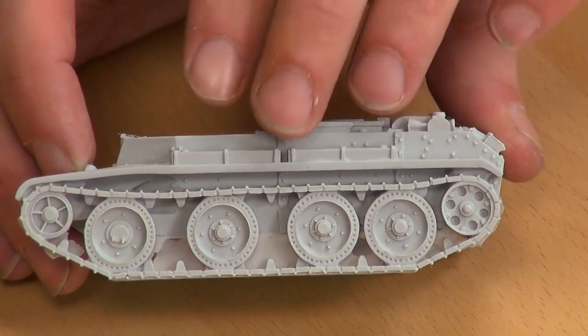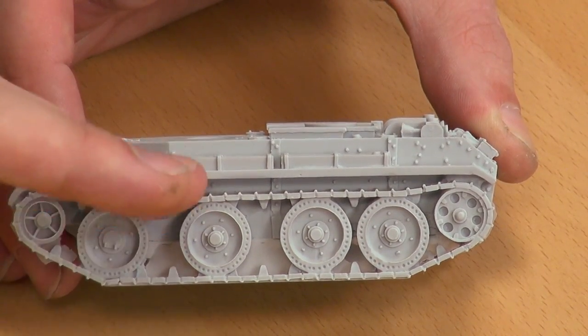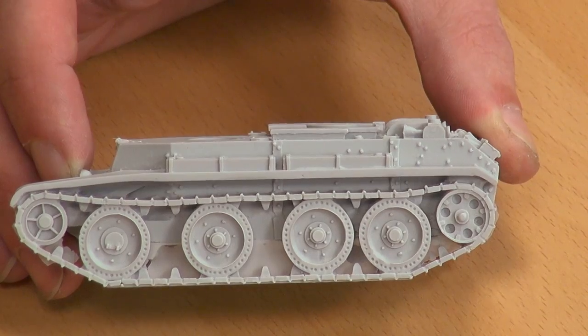Christie's suspension works like this: on the inside of the tank you have a box. Inside this box is a spring about three feet long, and inside that's a shock absorber. That hooks onto a swing arm on the side of the tank, which has about 14 inches of travel. So you can be shifting one of the wheels 14 inches — that's pretty effective. Let's put the hull under close camera so you can see these four road wheels, which have about 12 to 14 inches of travel. That's why the gap is so big from the top of the wheel to the top of the mudguard. They have to accommodate the spring inside the hull and allow for the suspension travel.